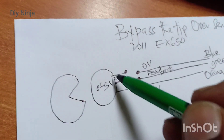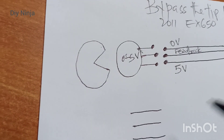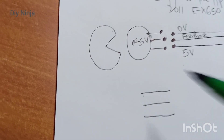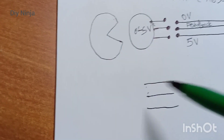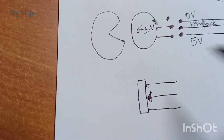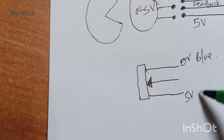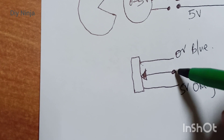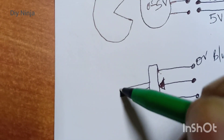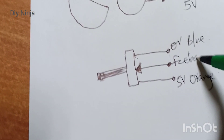To achieve this bypass, I used a potentiometer — a device with three connections, just like the volume control on most small analog radios. The middle terminal is the variable output, and the two outer terminals are power connections. You supply zero volts to the blue wire, five volts to the orange wire, and take the middle terminal to the green wire. You can then rotate the small rotor to set any voltage between zero and five volts as the feedback signal.